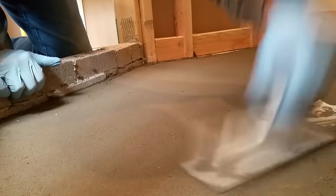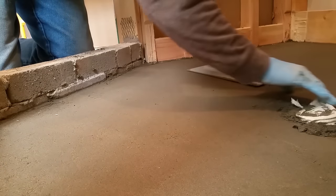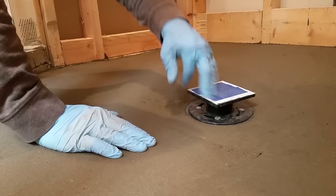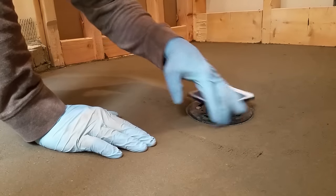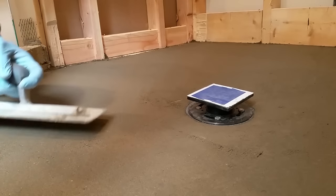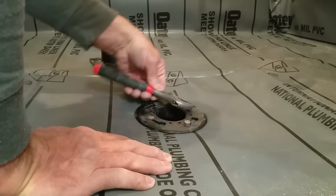The first layer of dry pack is now complete. The shower pan will go on top of this and tie into the drain. Then the flange goes on top of the pan with bolts that tighten it down, allowing you to adjust the height of the drain and also how much fall you have going to the drain when installing your tile. That's the way I mix and install a dry pack. The next video will go through the final steps of installing the shower pan as well as the top coat of dry pack before the installation of the finished tile.